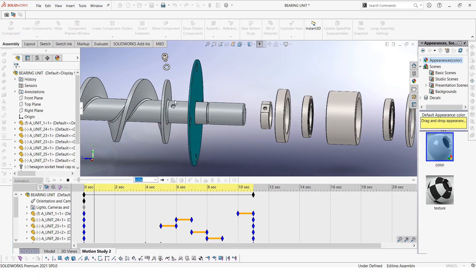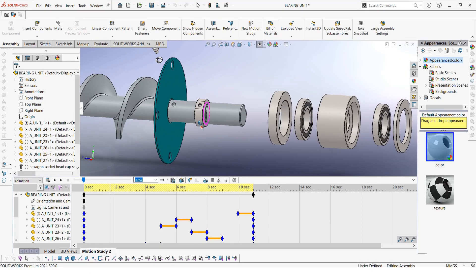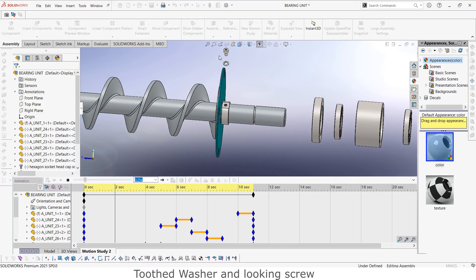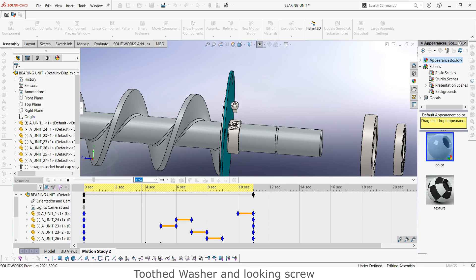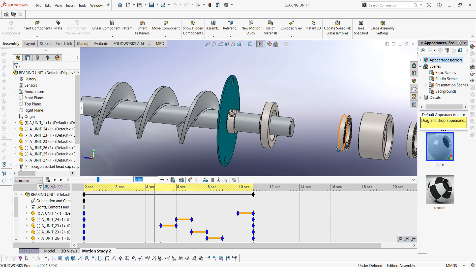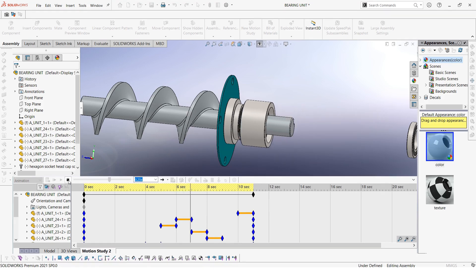Let's play as I explain. We have this split that will go in first. Then we have this piece which is used to lock the other components on the shaft. We have this washer which will sit there, then a bolt here that sits there. Then this piece here — it's just a spacer — and it is used to hold the round bearings in place. That spacer goes there, then the bearing will sit on the spacer, then this one will come and sit.